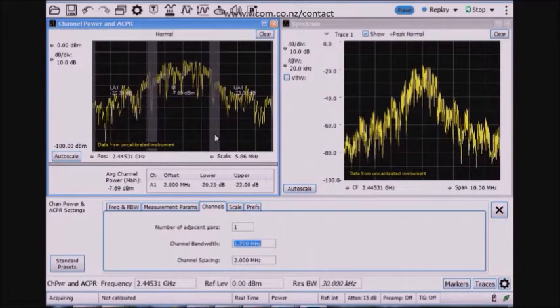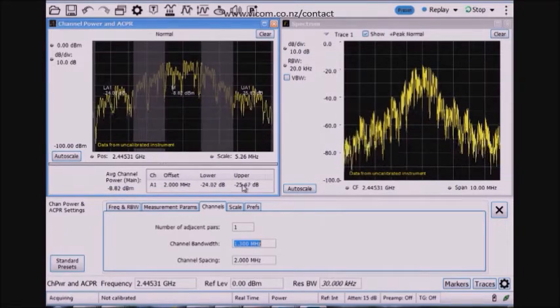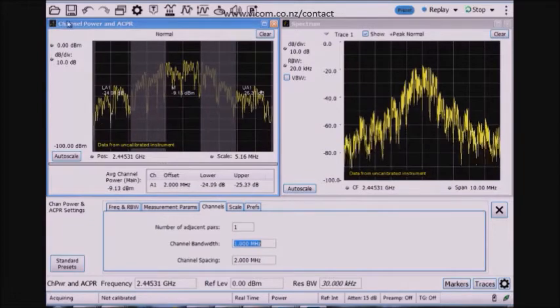And you can see these gray bars getting larger. So if it's really a 1 megahertz channel that you want to look for, there's a 1 megahertz channel where now you look at the main signal. Now the number got smaller here. Remember, a channel power measurement is the integrated power across an entire bandwidth. So in this case, a 1 megahertz bandwidth is containing minus 9.1 dBm, and then you have adjacent channels here as well.